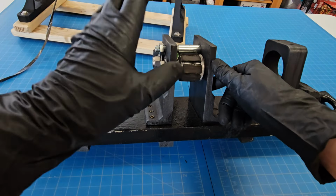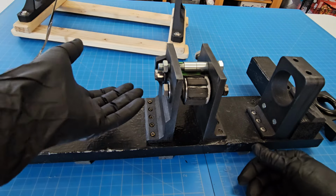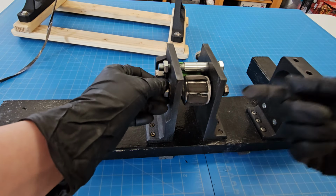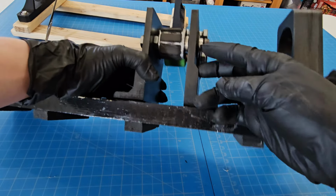It completely ruins the carbon because it just keeps feeding. I mean, there's no sensor on here. So if your carbon is getting destroyed, it's just going to keep happening until you notice and manually stop it. So that was another big problem that I had to fix for the next one by having one single through bolt. Other than that, the concept with this is the same.